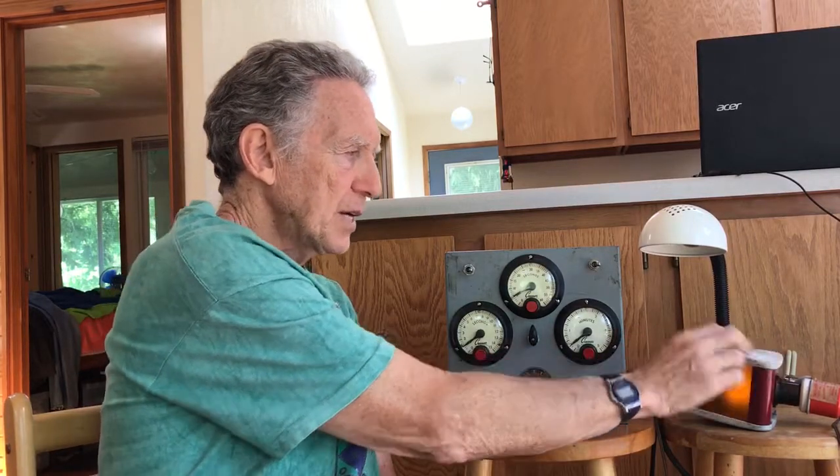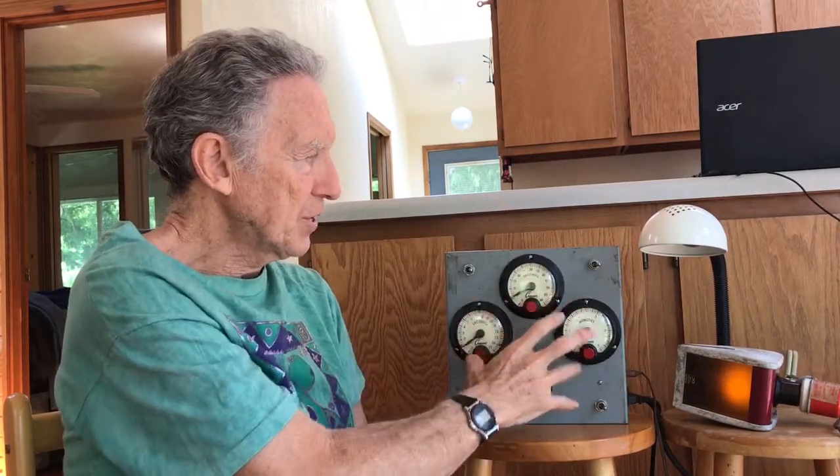So all in all, I was pretty happy with it — it had all the features I wanted in a darkroom timer. There's a duplex outlet on the side which allows you to plug in your safe light, in this case an antique Kodak safe light, and your enlarger. The duplex outlet has been separated into two units, and the wiring runs through this maze here and does the things that I described. It worked well for me then. Maybe it'll work well for somebody again in the future. I pulled it down from the rafters of the garage up at the lake house and figured I would share it because it's a fun thing. It's a bit of a project to build something like this, but I highly recommend those types of features in a timer for a darkroom — it makes life easier and more fun. Have a great day.